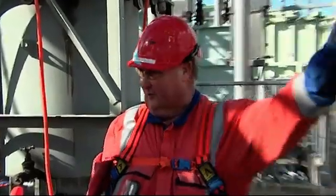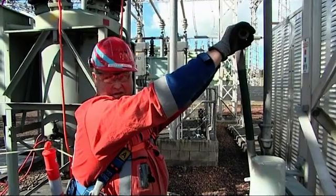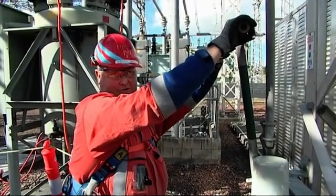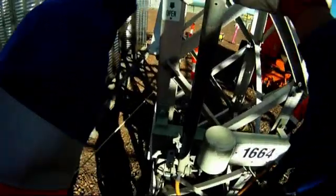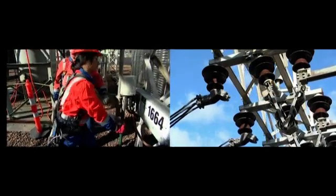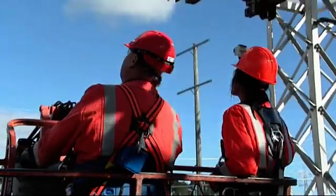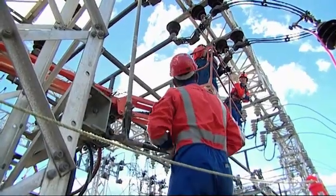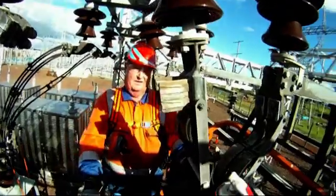These switches are very heavy because of the 2,400 amps, and you need to be able to stand with your feet apart, take your handle in both hands, and use your whole body weight to open it. Feet apart. The area is declared safe. It's time to head up to the job. Use your brake clean and clean all four faces with your rag.